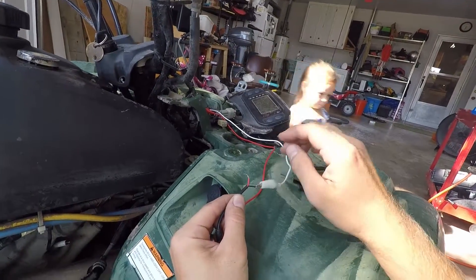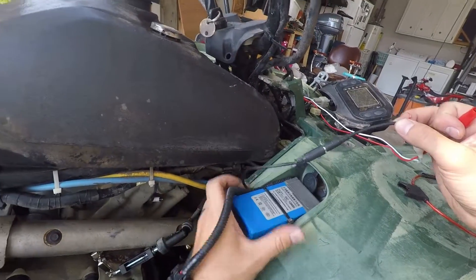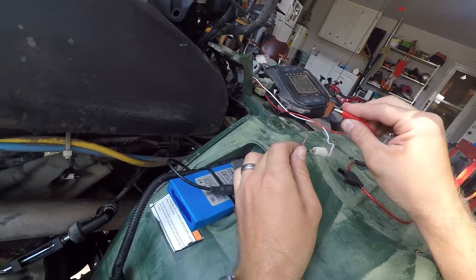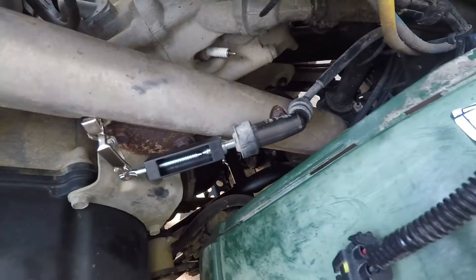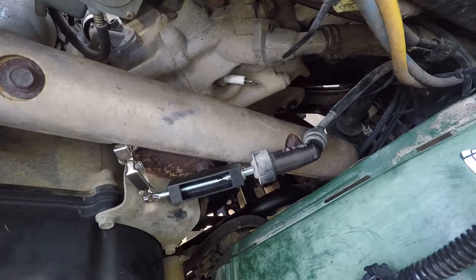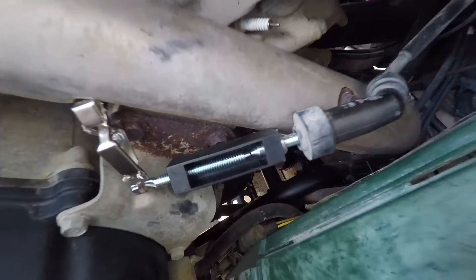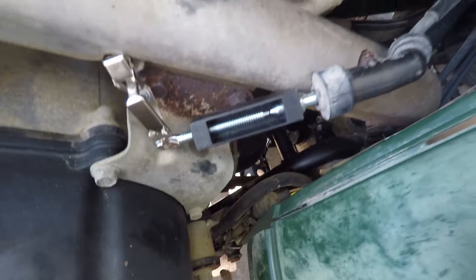So what we do is just connect the battery, but you're not going to just connect it and hold it because that's just making it a dead short. What I'm going to do is just quickly brush the lead and make contact like that. And while watching the spark gap, you can see a faint little spark in there — just like that.